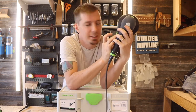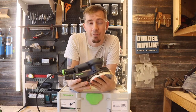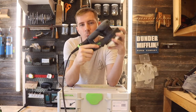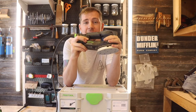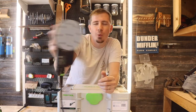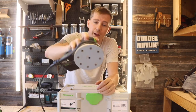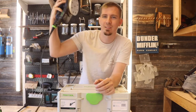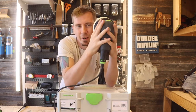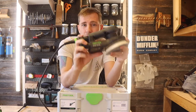This is a six-speed sander. If I'm sanding softwood and don't need to remove much material, I can lower the speed. If I'm sanding hardwood — something tough like oak or walnut — I can go all the way up. Being the cheapest Festool sander, it's also the weakest: a 250-watt motor compared to the EC 150's 310-watt motor. It's designed to be a one-handed sander — very light and ergonomic, fits well in your hand.